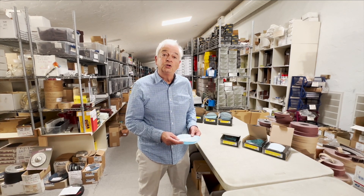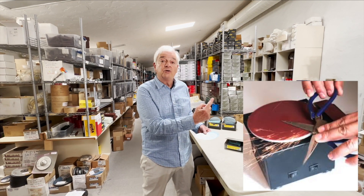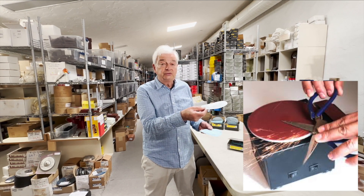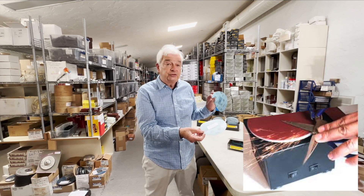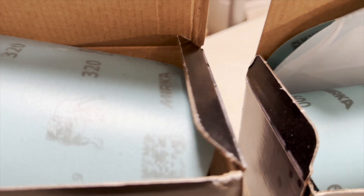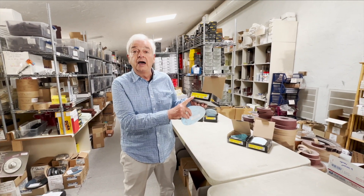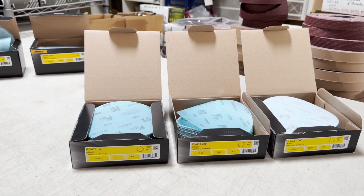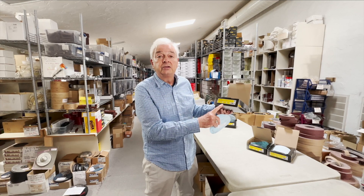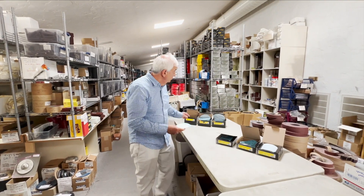Some of our sharpeners also sharpen scissors. They use a tool which rotates horizontally like a record player, and on that you put a 6 inch disc which can be either hook and loop or sticky back. I want to introduce you to a new technology by Mirka Abrasives called the Galaxy. These discs have a ceramic surface which will outlast most other grits on the market. We supply these 6 inch discs in three different grits: 320, 600, and 1000, in both hook and loop and sticky back.